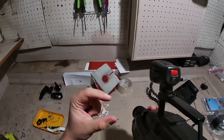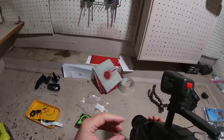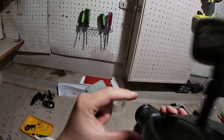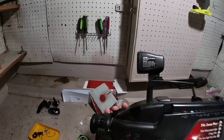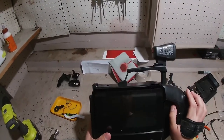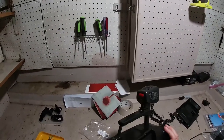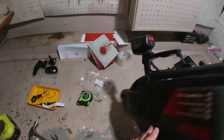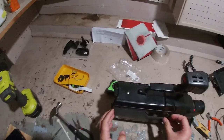It'll look like a normal camera from the 90s, so hopefully no one will want to touch it — but when you go to use it, you'll have all kinds of crazy features like a big touchscreen. I'll have either a viewfinder here; the original CRT is burned out, so I'll either fix that or just put a little LCD screen here that you can swivel and flip backwards to look at from the front. The image coming off of it kind of has a 90s look to it, which I really enjoy — it reminds me of documentaries I grew up watching, which is kind of why I'm doing this project.